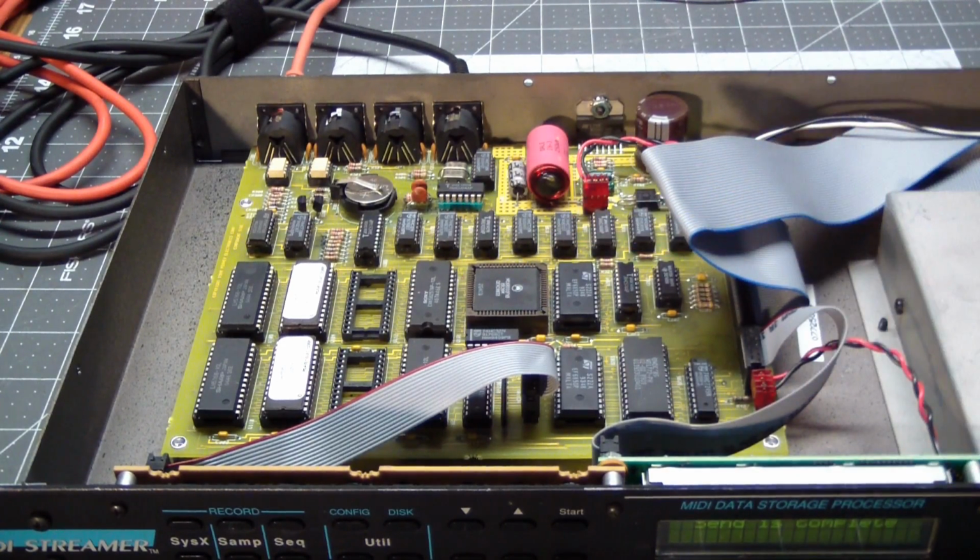However, if you do several reads, the official way, of course, is to write a routine that takes subsequent binary dumps and does a compare on them. But if you don't have it handy, I found that just staring at the binary dumps after several reads, your eye can detect if numbers are changing when they shouldn't be. When the pattern on the screen, which is the binary dump, changes, then you know you've got a problem with the EPROM.